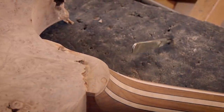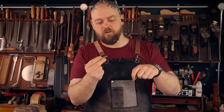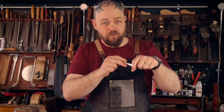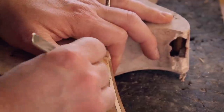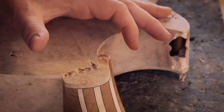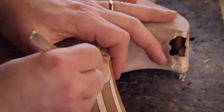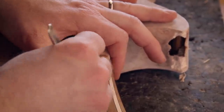So here's an interesting thing. I'm using my scalpel blade to scrape away the glue, there's an obvious excess of it. If I put my scalpel into the corner of the wood and then pull away, it tends to chatter. And that just accentuates over time and scrapes that chatter mark into it. By scraping towards the edge, I've got a long, slow run in, and I'm avoiding all chatter. I then do have a little bit of excess to carve away right up at the edge, but it's a cleaner scrape, as it were.